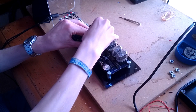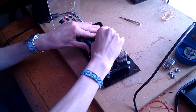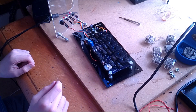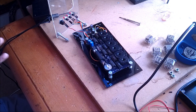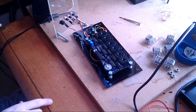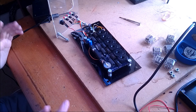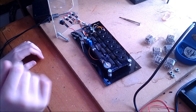These Nixie tubes are all socketed because I thought that was sensible. However, the sockets are quite tight and it's surprisingly difficult to get them out. Some people use only one driver chip to drive all the Nixie tubes, using transistors to switch between lighting each of the six — basically multiplexing them with only one driver chip. I didn't really see the point in that, because the driver chips are so cheap anyway, so why not just use six of them? It makes the coding a lot easier.